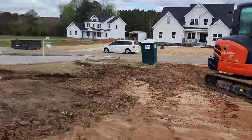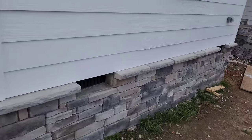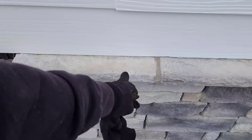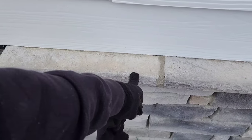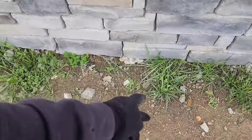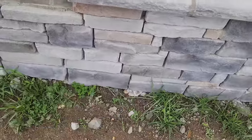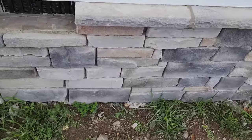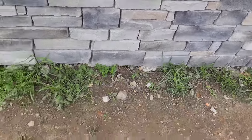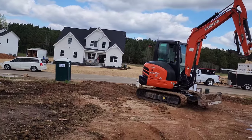The first thing I like to do is start at the house. If you remember, that was our vent, so we're going to come over about a foot — right here — and dig. We'll typically take two bucket-widths wide so we can hammer-drill through the foundation underneath and get in there big enough to work on it. I'm going to go ahead and put it on time-lapse and start the trench.